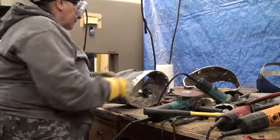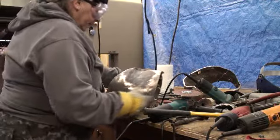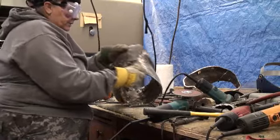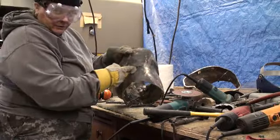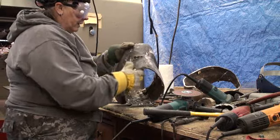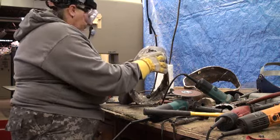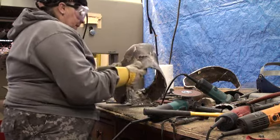So that's what that grinding process is like. What I was actually grinding on is what's called flashings — like here, if you can see this bit of metal. It's from a very thin crack that kind of naturally occurs in the investment mold, and so it fills up with bronze. I have to knock those away.